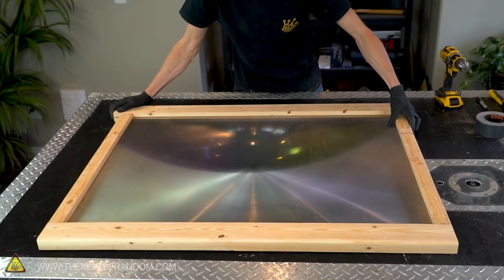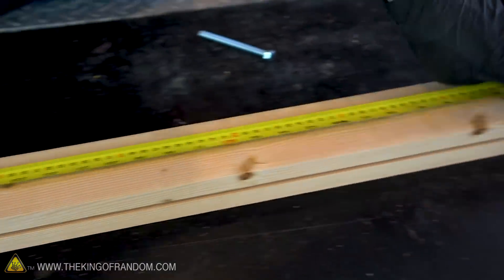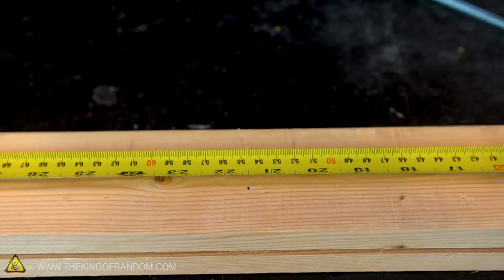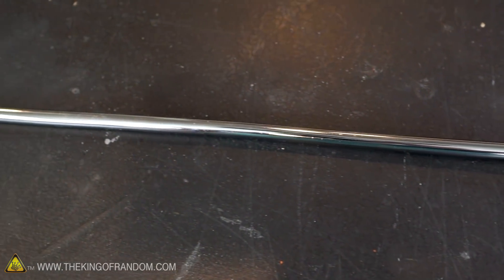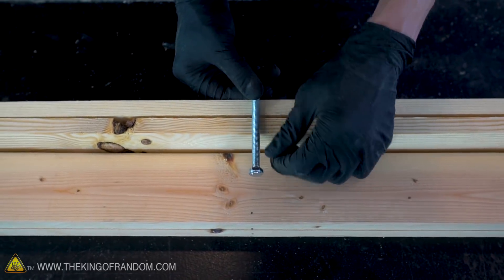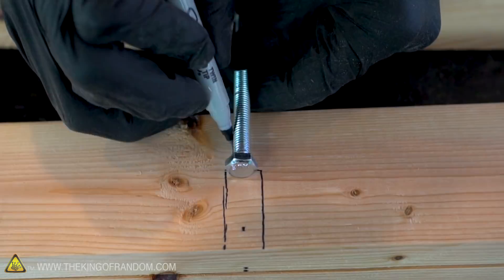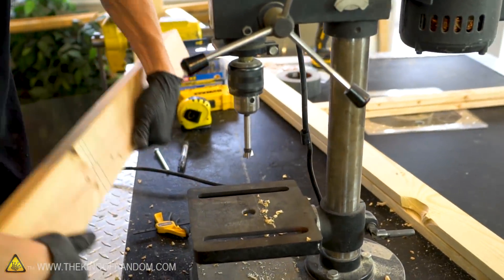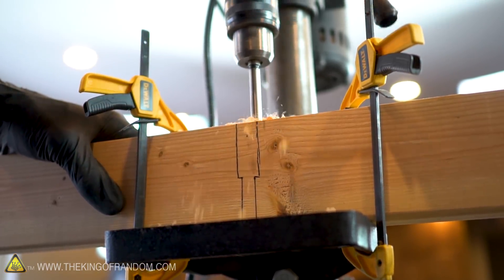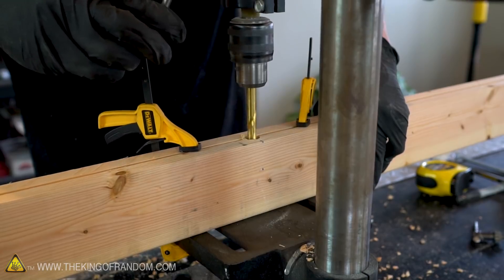The hinge on this frame is going to have a long bolt that runs through most of the side frame and then through the two supporting pieces that hold the frame up. We'll need to drill two holes into our two-by-four: one wide enough that the head of the bolt can fit, and one slightly narrower but wide enough for the piece of tubing. We're going to have some spacers between the frame and each of the legs. The larger first hole should accommodate the head of our bolt, and we now need to drill the smaller hole that will accommodate the copper pipe that our bolt will run through.